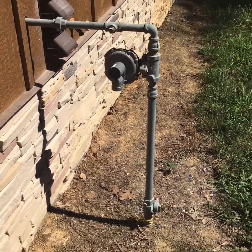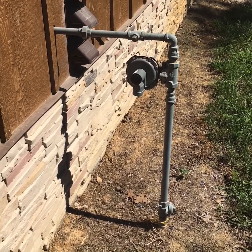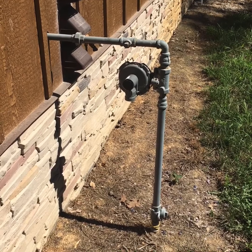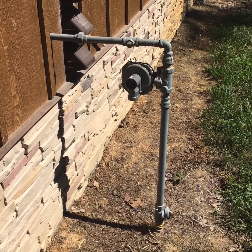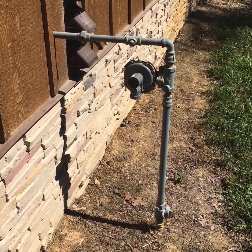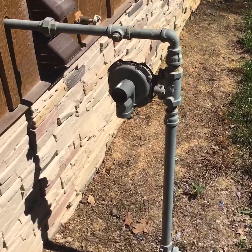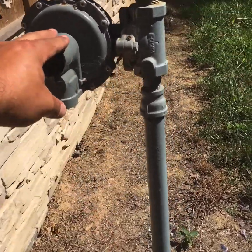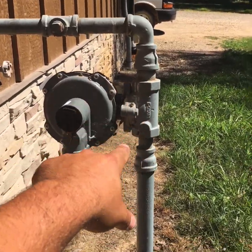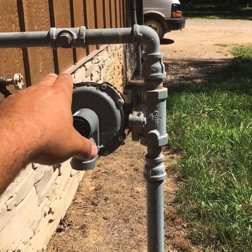What we have here — there's obviously no gas meter, just a regulator. The facility has its own gas distribution piping and one gas line meter at the very front. So we just have a utility line regulator. We have around 40 pounds of gas pressure coming in, and then it regulates down to two pounds going out.